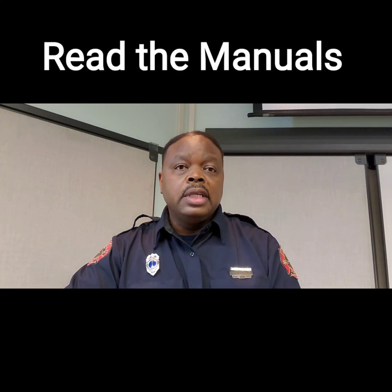It'll repeat itself again. So hopefully this helps — when you hear those beeps going off, without even seeing the device, you can say three beeps, your smoke alarm is going off; four beeps, that was your carbon monoxide alarm. And sometimes if it's a combo unit — smoke alarm and carbon monoxide alarm together — they may do something slightly different.